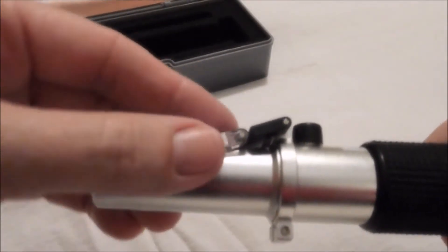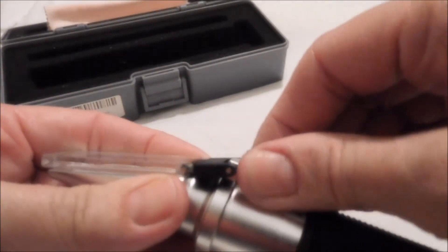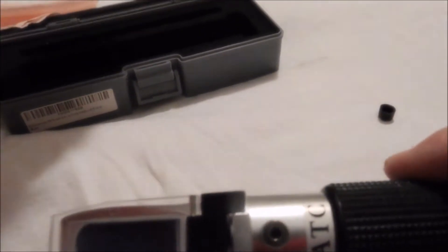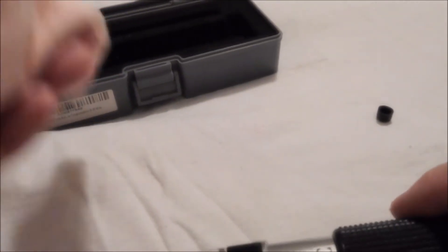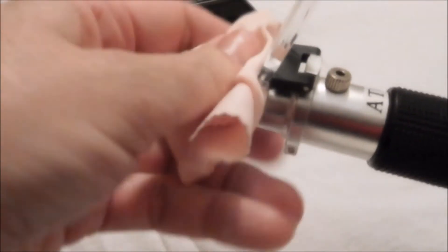When you put this down you want to make sure it's making contact - this black part pivots, and if you just put it down you're not going to get a proper measurement. So you want to make sure it's all the way down. If you do have to calibrate it, mine has a rubber cap over a screw, and there's a small slotted screwdriver - my kit included a very tiny jeweler's screwdriver. You also need to clean it in between uses with something very gentle, like a small microfiber cloth. You don't want to use hot liquid with this, as it can etch your glass and give you inaccurate or blurred readings.